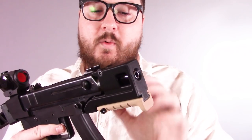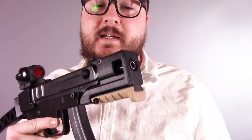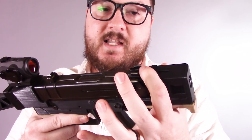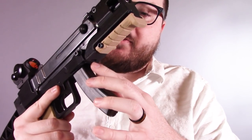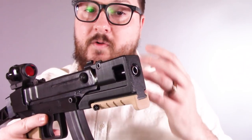So what I did is I went ahead and designed a clamp-on style front handguard with a rail mount, which you can't see because it currently has this hand stop underneath it. How this works is it slides over the trunnion — the big round portion at the front of the receiver — and then clamps in place. You can see it's got a slot there so that it gives it some flexibility to clamp in place. To keep it from rotating, it indexes on the bottom — there's a little hump at the bottom of the receiver — and then it indexes at the front as well. So it keeps it from rotating and from having any free play. This thing is on here rock solid.